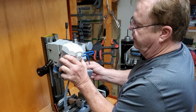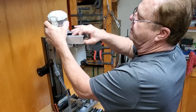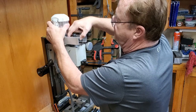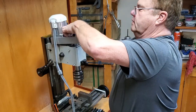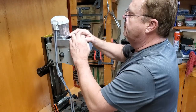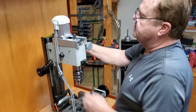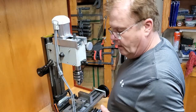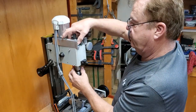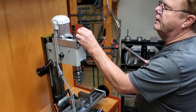Get your motor and put one of the mounting screws in. I like to put the keyway straight up so I can see where it is, then set it down on top — it's all going to go on at one time. You don't want the top gear too tight, but you can't have it too loose either. If it's too loose, the motor has so much power it can start twisting back and forth on the keyway and make a rattling noise.